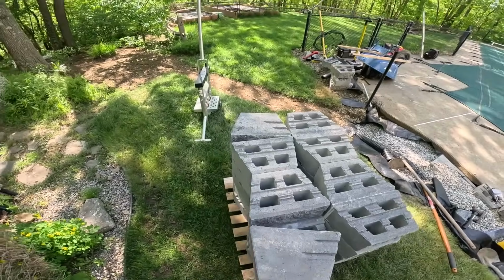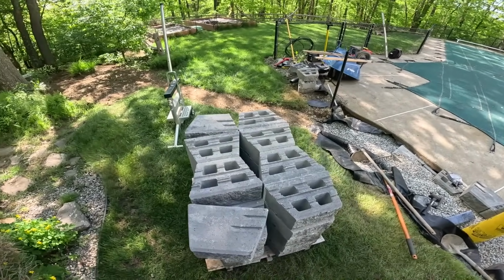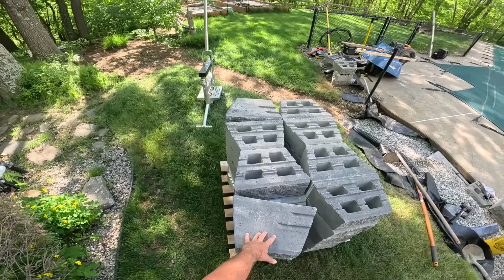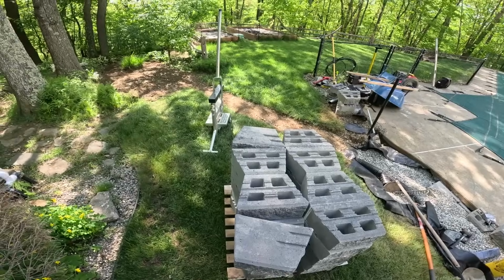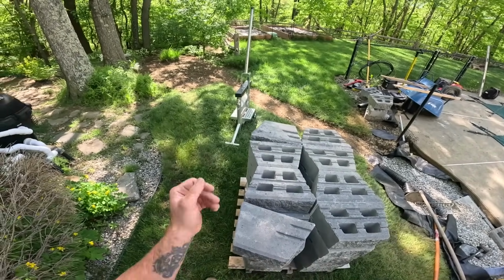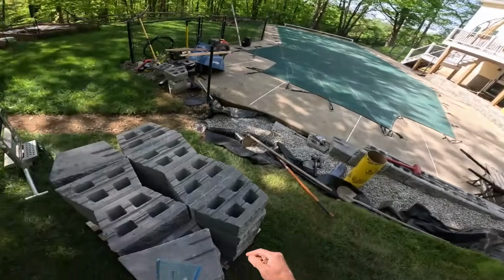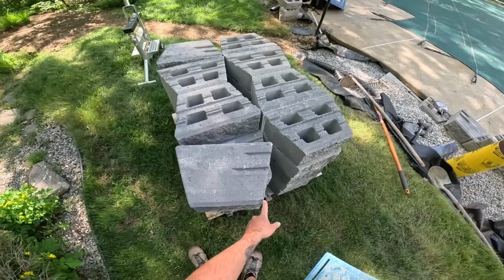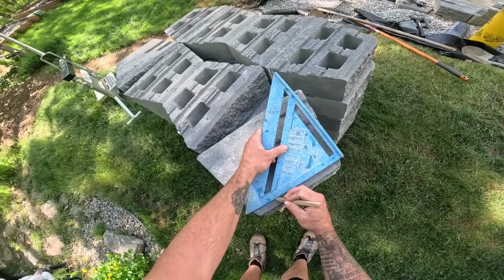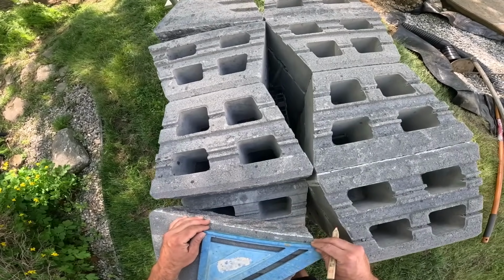Like I explained, I think it might have been the first video, which if you didn't see it, you can check out the playlist, link in the description. But this summer block, they give you 2 solids per tier of block for this very reason, so you can make and customize your own corner pieces with a block splitter. Like I said over there, I want this side to be able to sit up flush with the block next to it, so I need to take 8 inches from this measurement here. But so 8 inches is gonna be right there. There's a nice little bevel that you can line your square up with.